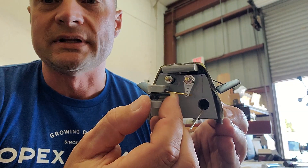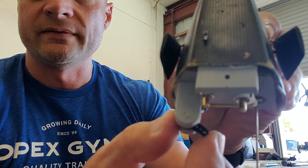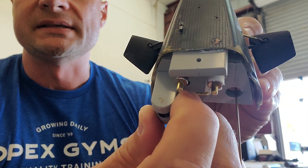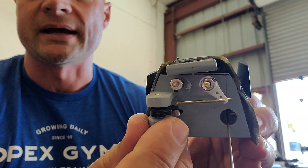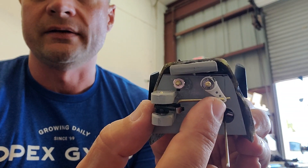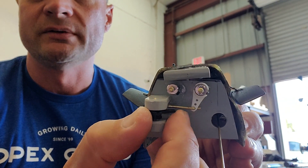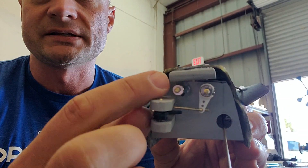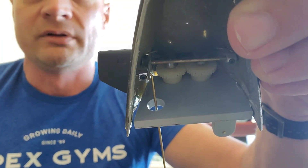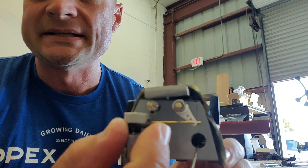We want to utilize linear motion from a servo, and that's what we've got here — a control horn right there. That is what provides the impetus for the bow planes to extend and retract. Looking at it end-wise, we've got a linkage horn right here, and that moves with the L-horn that I'm manipulating with my finger there. You can see this other shaft is rotating at the same time, because there is just a set of double gears on the inside. So that is as simple as it is.